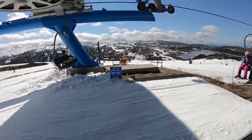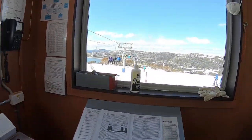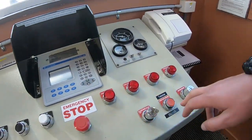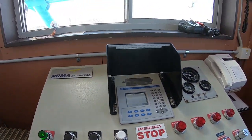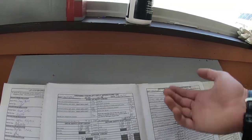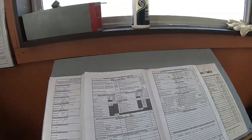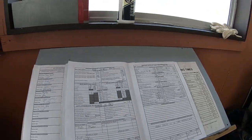Make sure your safety gate signs are out - there's also an open and unload here sign that needs to be out. When doing your training at Drover's, explain the tail stop bypass: if the tail stop comes out you won't get a reset unless you're holding the tail stop bypass, then hit reset to get a start. When doing your morning rounds, make sure your book is authorised and everything's signed off. For the zone leader check, don't sign it unless all names are in and everything's been signed off - the main ones that get missed are top and bottom enclosures checked, and queue setup.